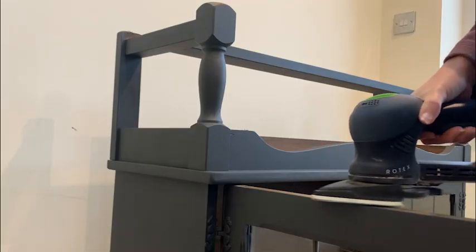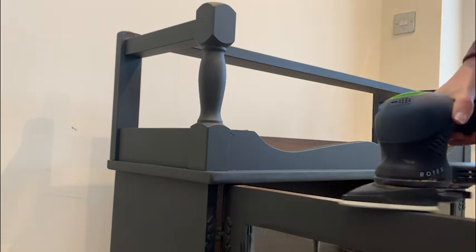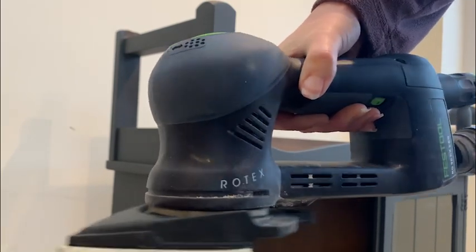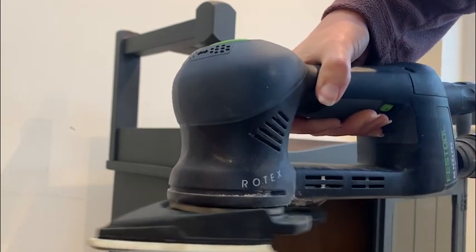It's always a risk when painting furniture because it makes the piece thicker and drawers and doors sometimes don't work as smoothly. In this case, one of the doors kept catching. There are two solutions: I could either move the hinge to pull the door up slightly, or I could just sand back the bottom of the door, which is what I chose to do. Those extra few millimeters that it took off the bottom of the door means that it shuts smoothly again.